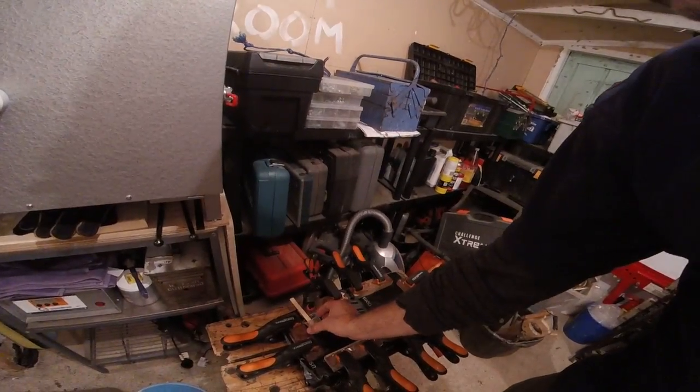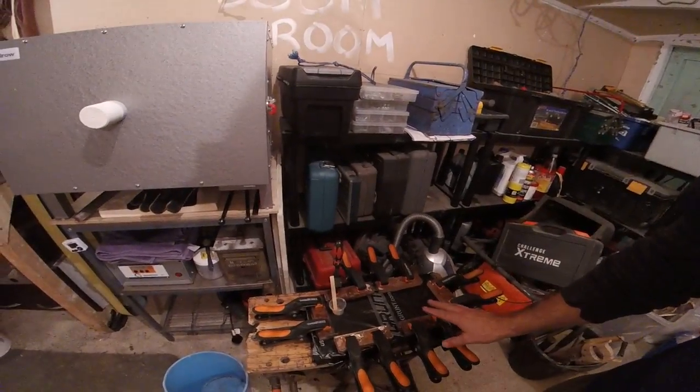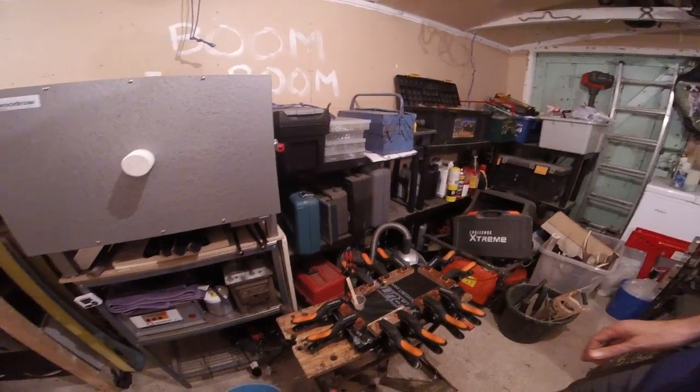That's the preference I have at the moment — we'll see about that going forward. What I do is when I've actually mixed the resin, I leave a little bit in the pot, and that just lets me know when I check it that the resin has gone off properly, because it's the same batch. What I've got here is some of the wood I've stabilized — Kauri, Rimu, and Matai — and they'll all stay there for 24 hours.